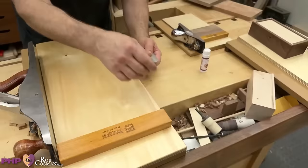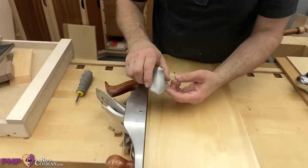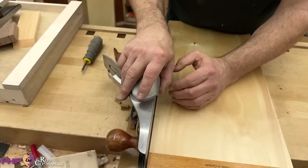This brass pin has a 1/8 inch diameter hole through it. So you're going to back this off. Pull it in so it's flush. There's a magnet on there just to help hold it. Get that where you want it. When you decide you have it where you want it, remember, your two set screws are sticking out a little bit, so they're holding this out from the edge of your plane, just a small amount. Take an 1/8 inch drill and drill down through this brass pin. That's your guide, and that'll give you a pilot hole in your plane.